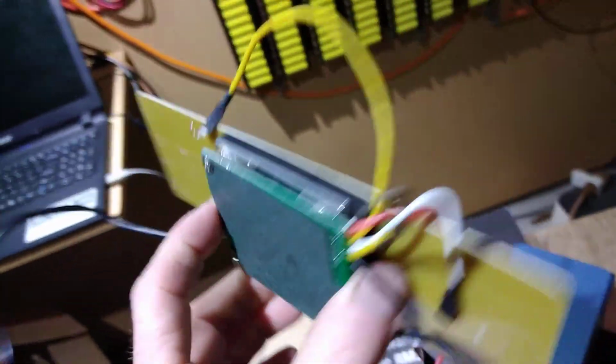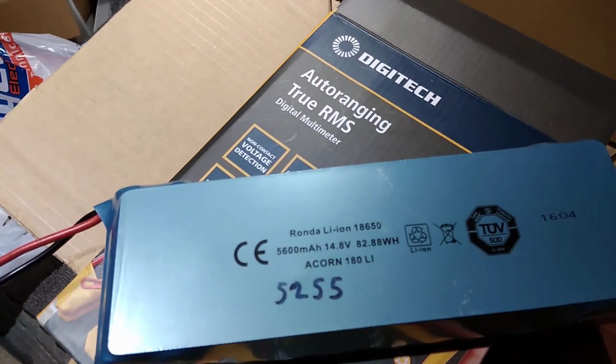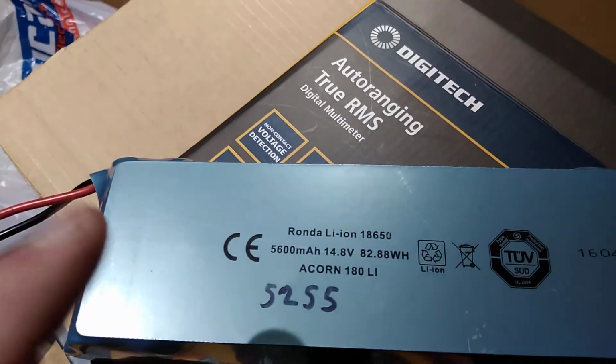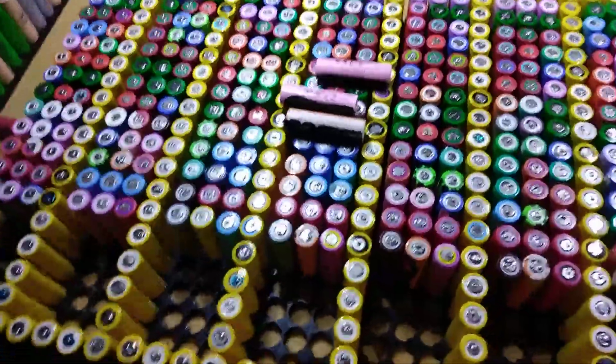Now I'm suspecting, being a medical pack, according to Google, but if anyone knows what they are, let me know. I'm suspecting that if it's anything like Average Joe says, in line with America, they have to swap them out once a year regardless. But I did do a test on them. These are the cells that came out of them, heat shrink, and under it the paper. And all around at 1480, 1500, so on average they're 1500 milliamp, which is what that would equal divided by the 16. It's a 4S 4P.